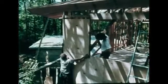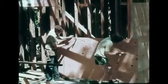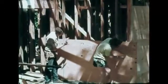The plywood is nailed along each stud with 6 or 8 penny nails, again depending on the thickness of the plywood. The even spacing also provides a convenient nailing surface for 4 by 8 modular interior wall coverings, such as wallboard or paneling. Because of the plywood's strength and rigidity, the diagonal wall bracing can be removed after the sheathing is completely nailed off.